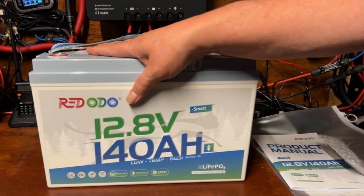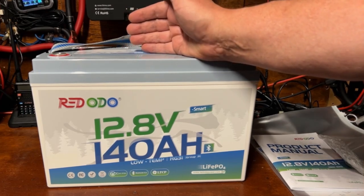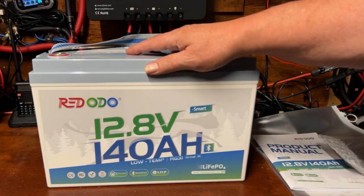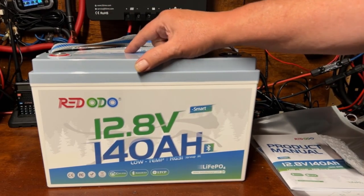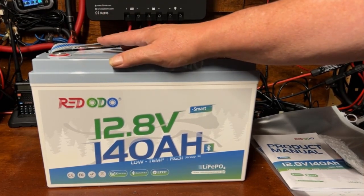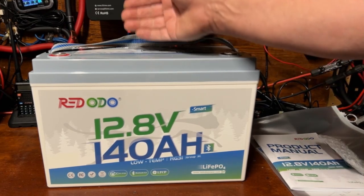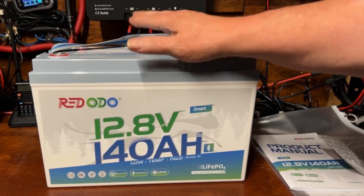That's what I like. I'm always preaching about needing two 12 volt batteries if you're going to do any sort of cooking, because you need to run a 2000 watt inverter for any efficiency on a standard induction cooktop. But with this one it's different — you have a 150 amp BMS and 1920 watts is the max draw, so it pairs nicely with a 2000 watt inverter. We're going to test whether it actually shuts down at 1920 watts later in this video.